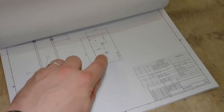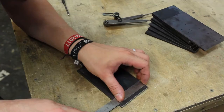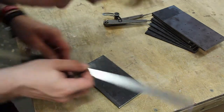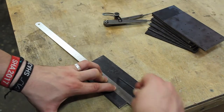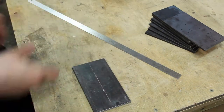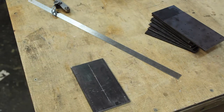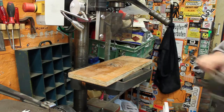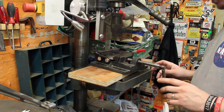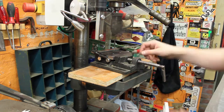Right now I want to focus on drilling these two holes. With these two holes, this whole stack is attached together. Let's mark these. Now let's set the 48mm distance, and then let's drill this with a 5mm hole. I've set this jig up — these bolts are under here as improvised parallel pieces. This clamp is here so the pieces can't move laterally, because the top two are not as tightly clamped in as the bottom one.